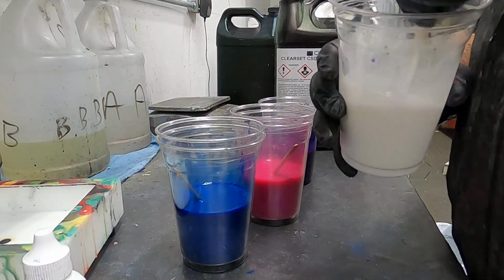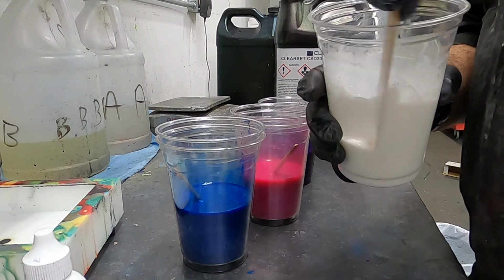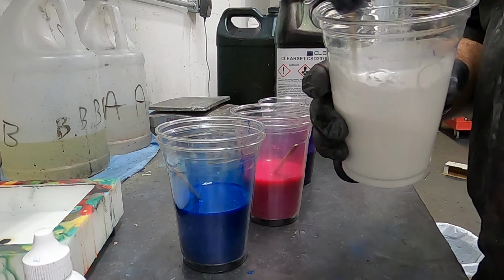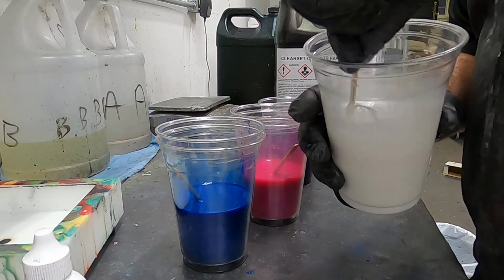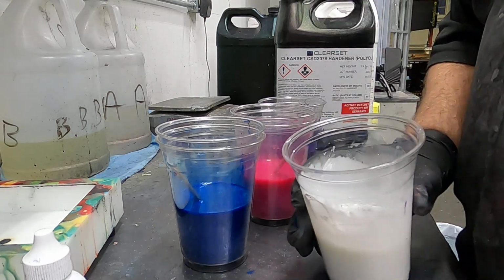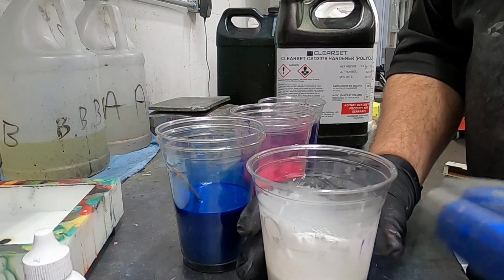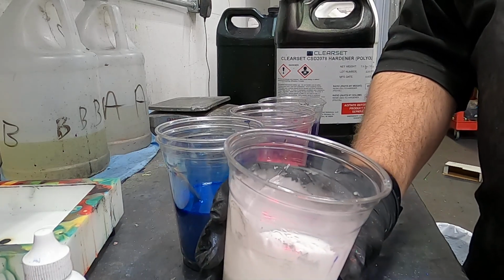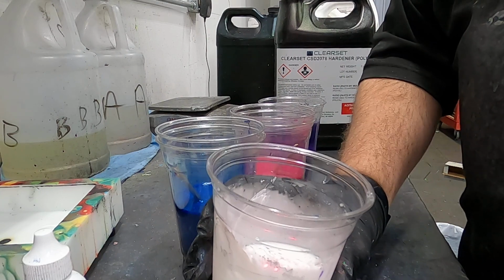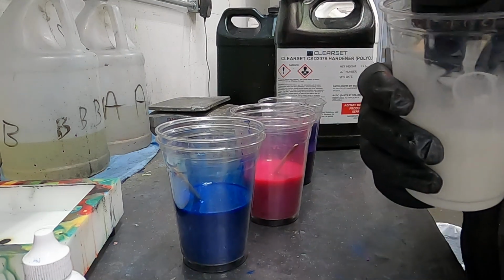When we do long tubes, we cast 24-inch long rods. For that, we'll use between 80 and 100, but for a block like this, there's really no reason you'd need anything more than 40. Some people worry about the pressure pots leaking. As long as it's got pressure for the hours before the demold time, you're fine. If it holds pressure for 4 hours, that's all you need. After that, the pressure's not doing anything for you. 82.5. All right. Should get there shortly.